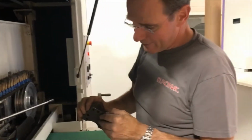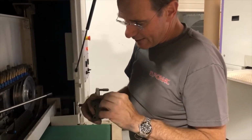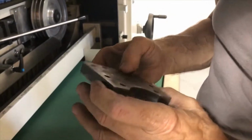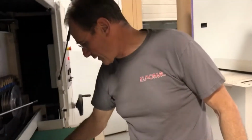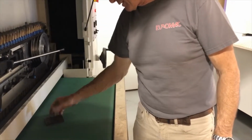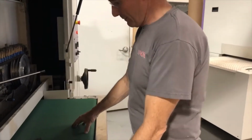But if you have a little bit of a step in here, like you have from your laser cut, in that indentation in the bottom, very often you don't get a very good and clean result. And we tested this, and we only have one of these belts, so when we run the part, we would have to run it first like this, and then 180 degrees, so that we come in from both sides, like if we had two belts on the machine.